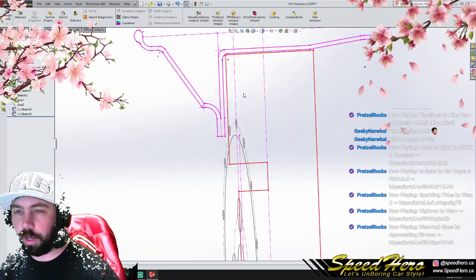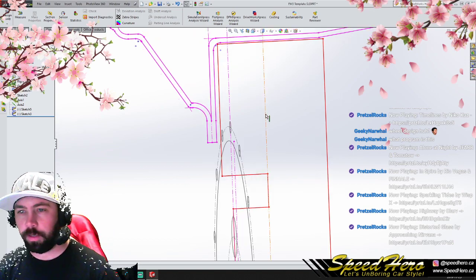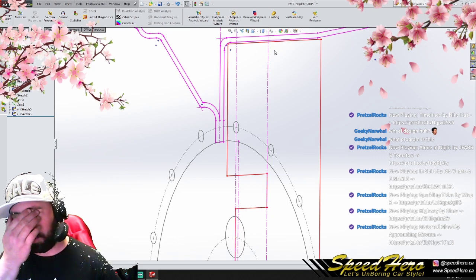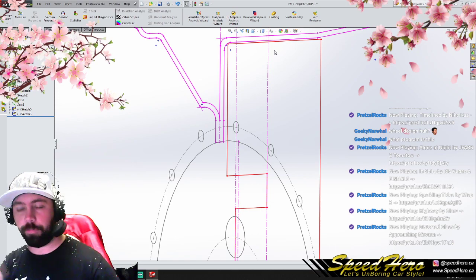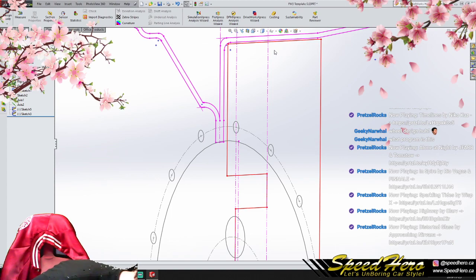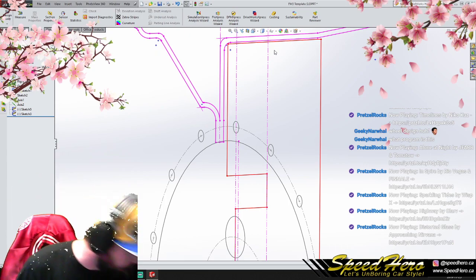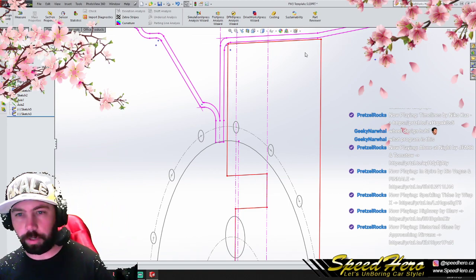This lip here and the way this brake sticks out is a little bit excessive. It is likely that the caliper won't stick out this much. We're actually considering a singular bolt. The way the Mazdaspeed caliper is bolted is annoying. It's got a banjo style bolt that it bolts to. And so we have to consider that. It's what sticks out the most and can't be adjusted or played with from there. So, we got some problems here.